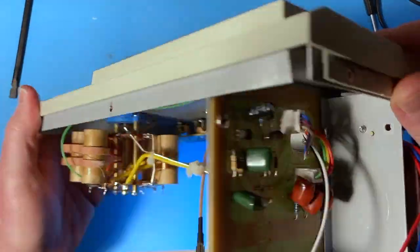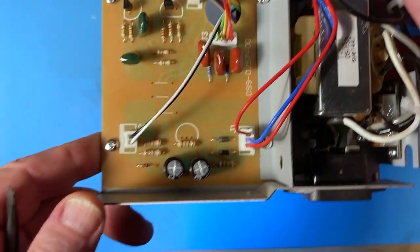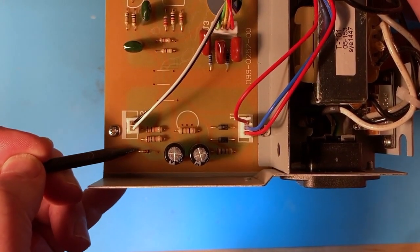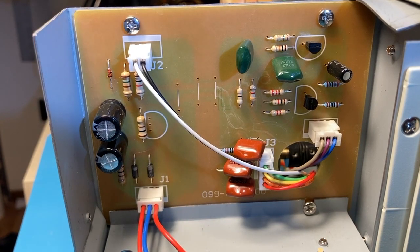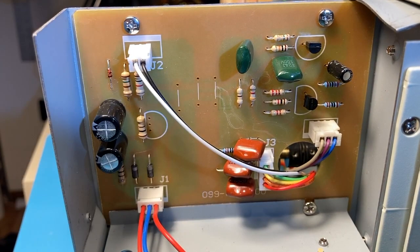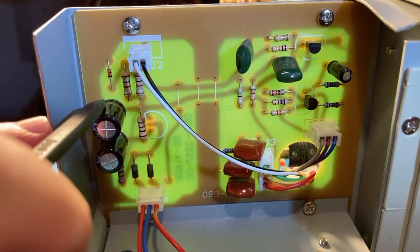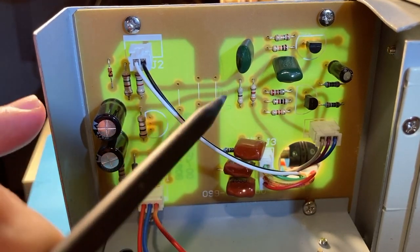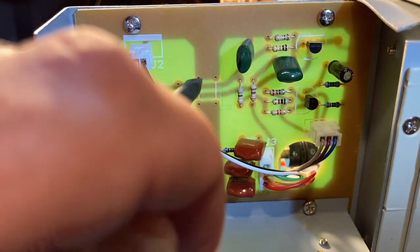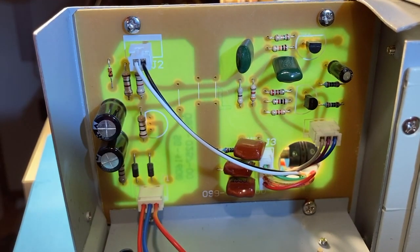So where do we tap in physically? Here's the front of the unit, and if we tip it up on end, we have the power transformer, then the pi-network voltage divider, then the Zener diode — that little guy right there. Here's a better view — here's the Zener diode where we want to take the power off. There are some no-stuff locations — places where they could have put a component and didn't — with nice holes through the circuit board. Following the trace from the Zener to a no-stuff here, with a ground plane no-stuff nearby, I can desolder those, stick the resistor in, and run the wires out to a power jack on the side.